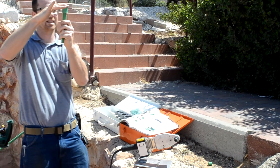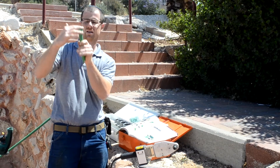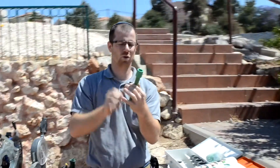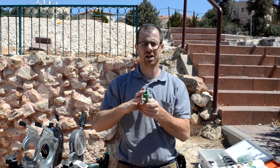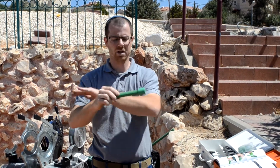Hold it there for about 10 seconds, make sure it doesn't move, doesn't pop out. And you have, according to the chart here, 2 minutes of cooling time — make sure you get the cooling time. You don't want to rapid cool it; make sure it's 2 minutes of cooling time. This becomes one pipe — this is not considered a connection, even though you see a connection. But inside, it melted, it fused together, and it's considered one continuous section of pipe.